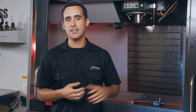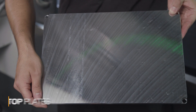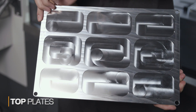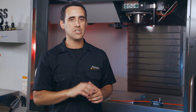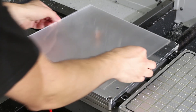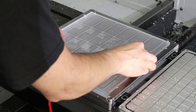And finally, we clear anodize them to provide a barrier against electrolytic corrosion between the chuck and the table. Now, if you have parts that don't match the grid pattern — usually smaller circular parts — then our customizable top plates are the perfect solution. They're three-eighths-inch thick aluminum plates in which you machine a gasket groove to match the profile of the part. They're also perfect for locating second-op pieces using pins or even putting the parts in pockets.